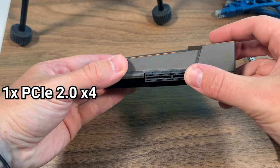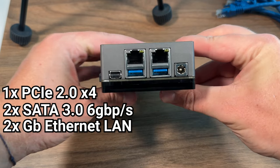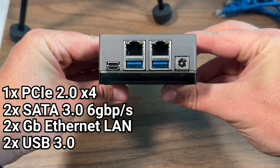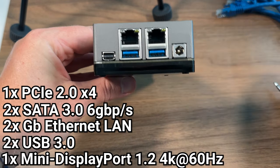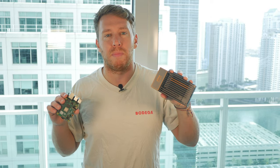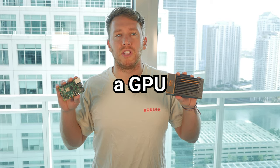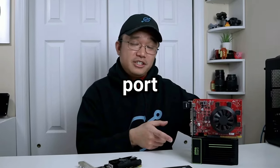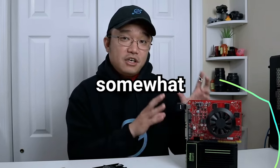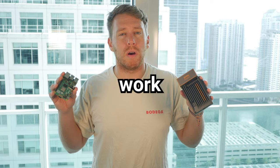The anatomy of the Zimma board 832 is as follows: it features a PCIe 2.0 x4 port, two SATA 3.0 ports, two gigabit ethernet ports, two USB 3.0 ports, and a mini DisplayPort featuring 4K at 60Hz. The dual ethernet ports make it a great platform for a personal NAS or a router. You could also plug a GPU into this PCIe port, though performance would be held back somewhat by the x4 interface and likely result in a CPU bottleneck.